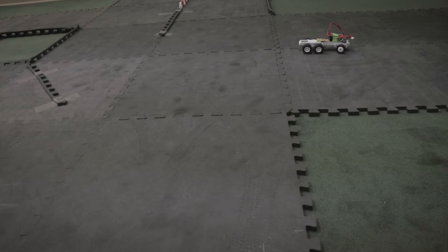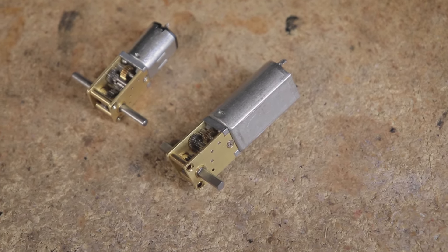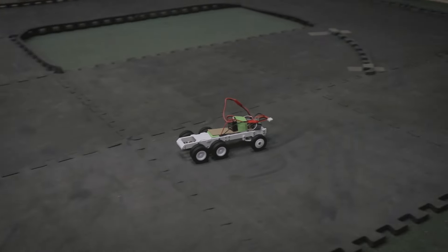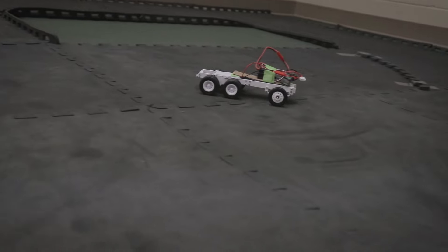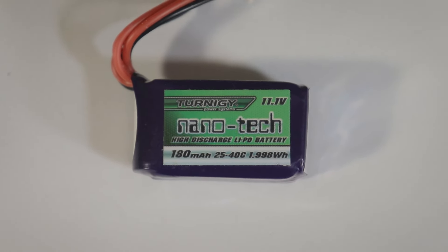As mentioned previously, adapting this chassis to use stronger and higher speed motors, such as an N50 size motor, is something we're considering. For now though, keep in mind that these N20 size motor and gear assemblies are like three or four bucks a piece, and while not amazing, they will work. For any builders out there, I would certainly recommend running these 12 volt motors on 3S to get as much power as you can out of them.